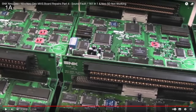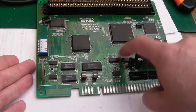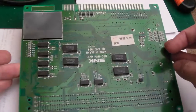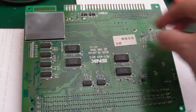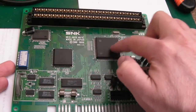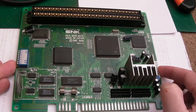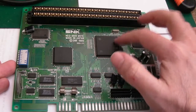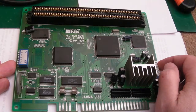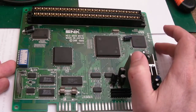They've effectively reduced it to three main chips, a CPU, a ROM, some 74-series, a clock chip, and some RAM. Flip it over and you've got some different types of RAM and buffers — there's literally nothing on this board. It's incredible they were able to reduce most chips into this large ASIC. From what I understand, that's the main thing that fails on 1Cs — if it's got a fault, it's going to be this chip. The controller inputs run through here too.